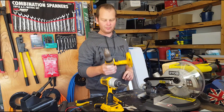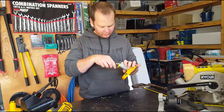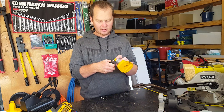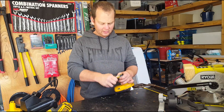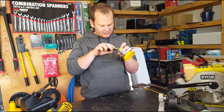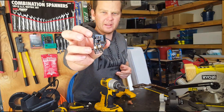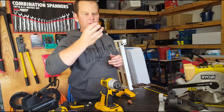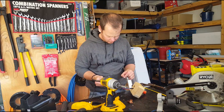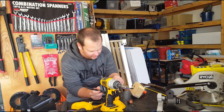I've got one of these — it's an old drill, it's stuffed. What I'm going to do: once you get that bit with the bottom of your trigger, which has the contacts for the battery in it, you want to just clean it all up a bit so you've got nothing there that might short your machine out. I've basically got rid of everything in there that could possibly contact with anything and short it all out. Get your dummy battery that you made.